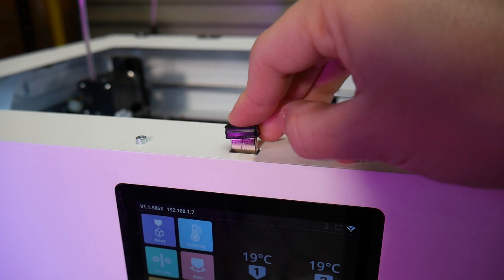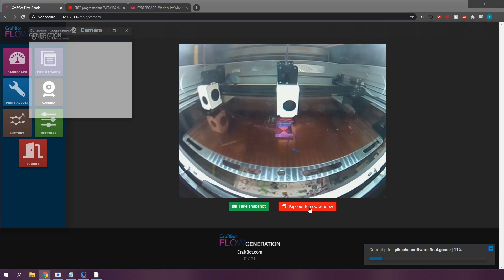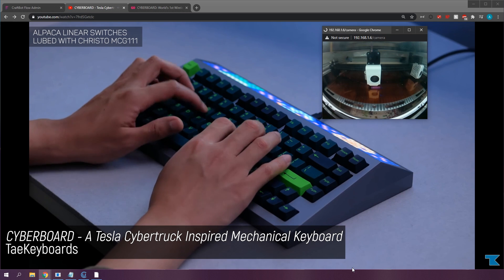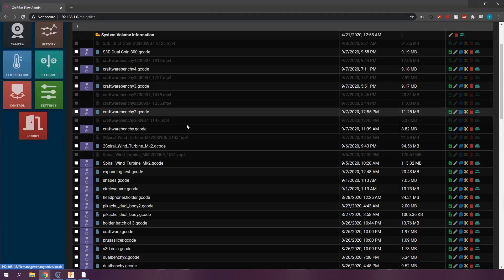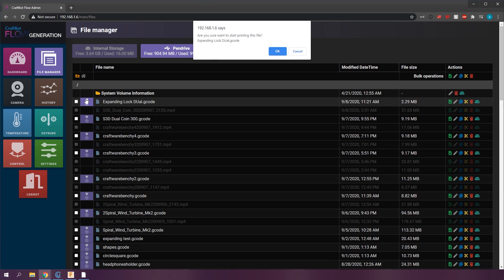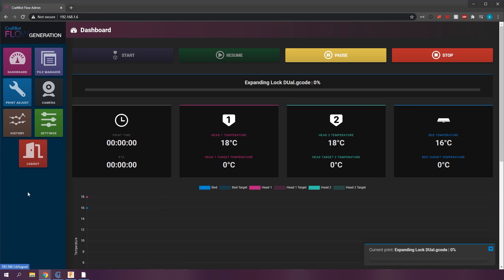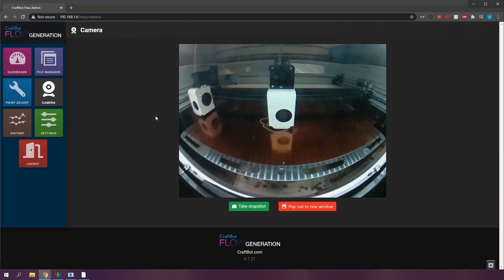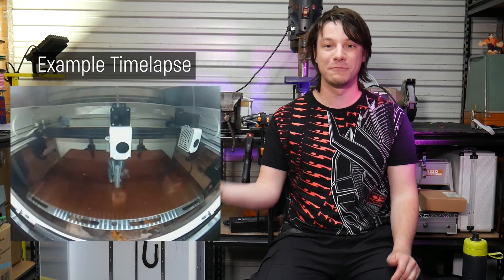It has internal storage alongside USB storage, as well as IoT integration and a built-in camera. You can wirelessly control this machine on a network and watch the print in progress — it's the ultimate lazy maker's tool. You log into the wireless through your printer's interface, find that printer's IP, and access it from another computer on the same network. From there you get an interface where you can upload or download G-code and other files. It can even do a time-lapse using the webcam. You can start or stop prints, pre-heat, go into the webcam, and monitor the prints in real time. While doing long prints through the night, this feature has been amazing — I'd just log in and check to ensure things are going well.